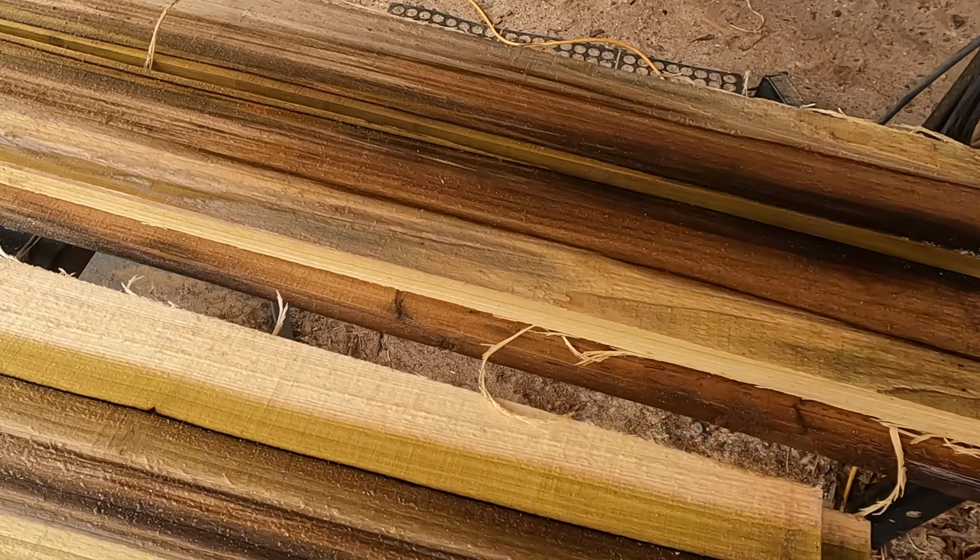So here you go, folks. I was able to isolate the shake in the boards in the direction that I wanted them to. I was able to maximize my yield. When I did have shake or delamination, I was able to put that on the edges of the board so I don't ruin the main boards. Had very little waste, turned out with some beautiful wood.